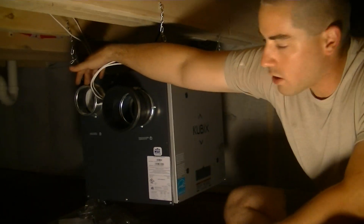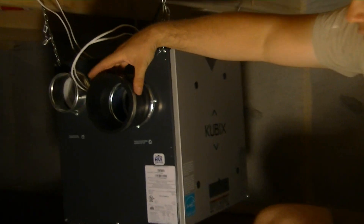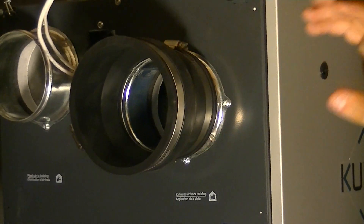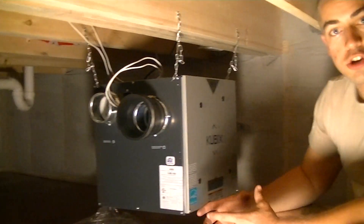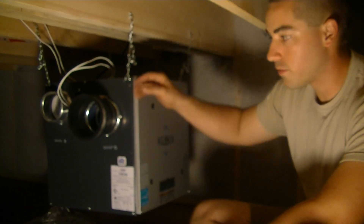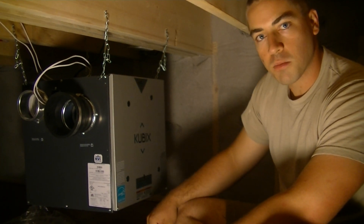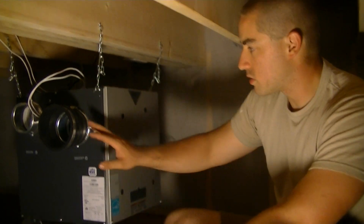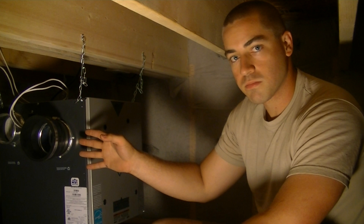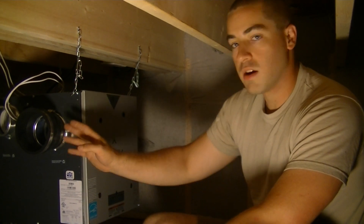To make the connection — because this is all rigid metal four inch that came on the HRV — I went and bought a regular rubber reducer. This is a four inch to three inch reducer meant for PVC, but because the outside diameter of PVC is larger than normal, I was able to squeeze the three inch end of the rubber onto the four inch metal duct line that came on the HRV. It took a little bit of effort, but I didn't have to crimp the metal or disfigure it — just took a little strength and it went on. Now the rubber provides isolation for the vibrations and also makes a near-airtight connection.